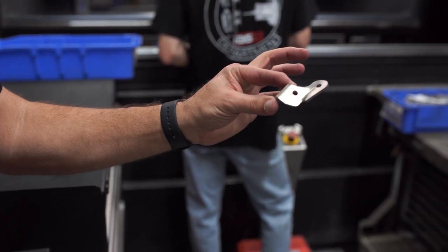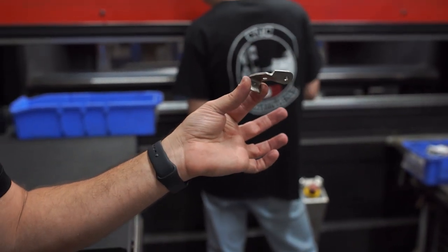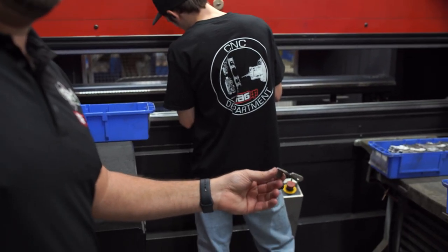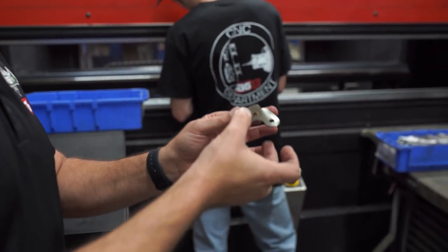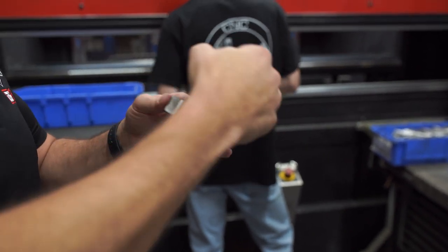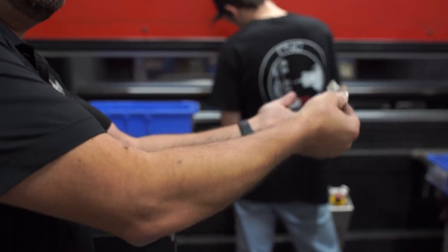There's an example of something that gets bent a few different ways. So it started as a flat sheet, a 5x10 sheet, gets surface finish, then it goes through this, gets bent, and then basically goes to the next stage, which is going to be welding. This will actually get a pin added to it that gets machined in the CNC area and will get welded to this part to come up with a bracket that then does something else.